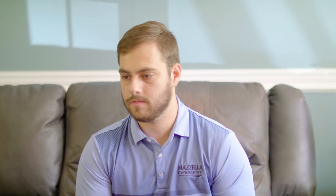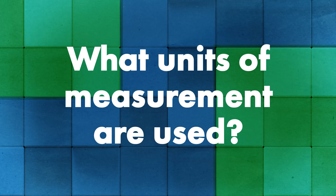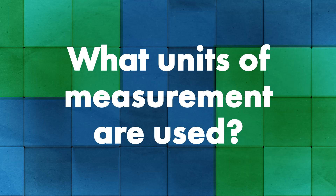What are the actual units of measurement used in those tests? We use pounds — pounds of pulling pressure. We could do it in compression, but the connection is going to be weaker when you pull it apart, so we want to go with that lower value. We should distinguish between pounds and PSI: pounds is your load and PSI — pounds per square inch — is your stress, which is a force spread out over an area.